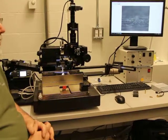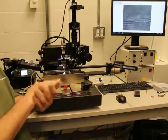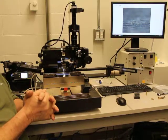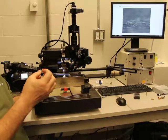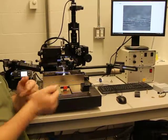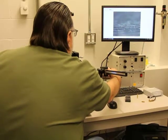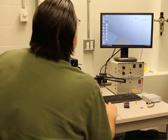Okay. So if you were just doing, say, that flex circuit, just soldering something that had lead-free solder or micro BGA or some micro bumps, normally with that type of application you would just heat from the bottom and let it reflow on its own. If you were doing a gold to gold bond, that requires heat from top and bottom and force. And basically, let's move this back down here.